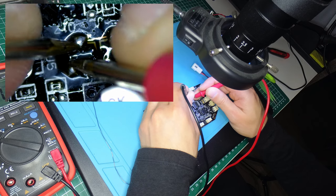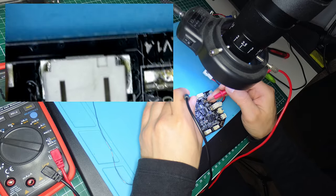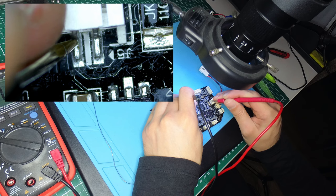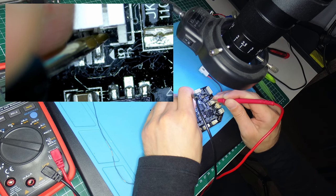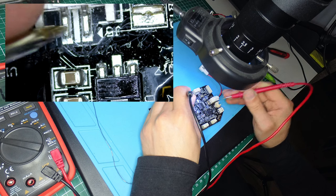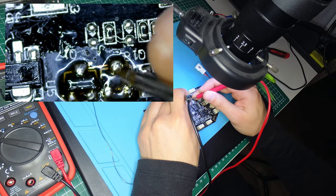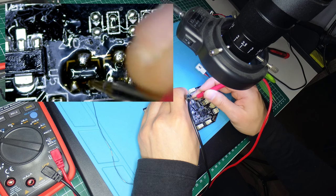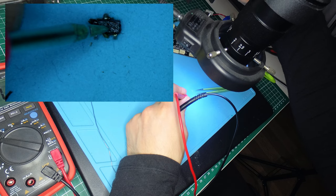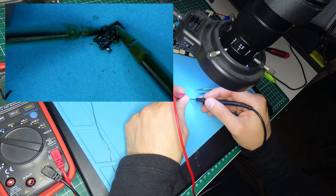First out is also the faulty one, the short is gone. Now I will order some new MOSFETs and I will continue when the parts arrive. The motor should spin even if one of the MOSFETs is out, but this is not a good idea because the current draw may exceed the continuous drain current of the good MOSFET.